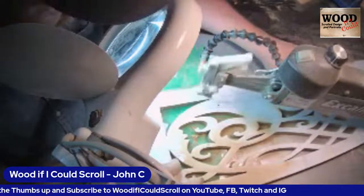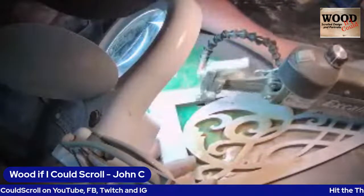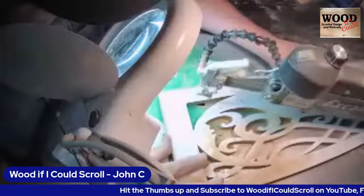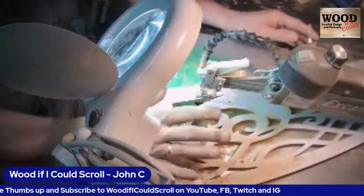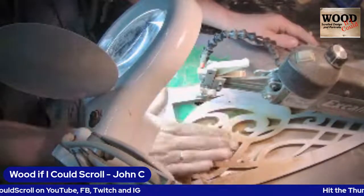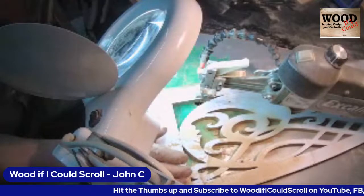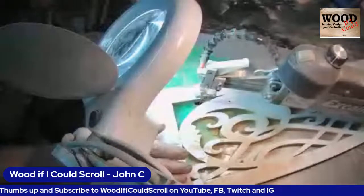Jeff Grover says, John, does press and seal work on MDF? It probably does, but I didn't use it. Reason being is because I don't feel like sanding down my MDF, because the problem with MDF is that if you put a sander on it, it basically digs right down and you'll end up with a curvy surface. I don't know if it'll get clean enough for it to stick. I'll try it on another piece though, just to see if it does work.